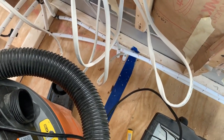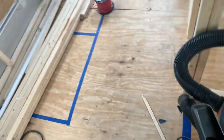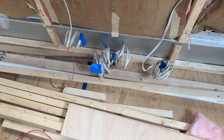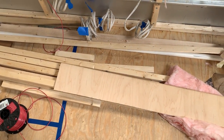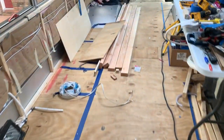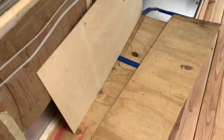We have a utility closet here - we drilled down through the floor of the bus into the underbelly storage compartments. I used PEX to insulate the wires coming through, and it looms all the way across underneath and back up into our power cabinet. We're using basically Nomad's idea - underneath the lower bunk is where our power cabinet will be housed. Our 24-volt DC leaf batteries are going to be in the underbelly storage.